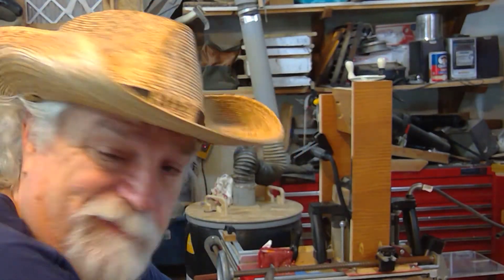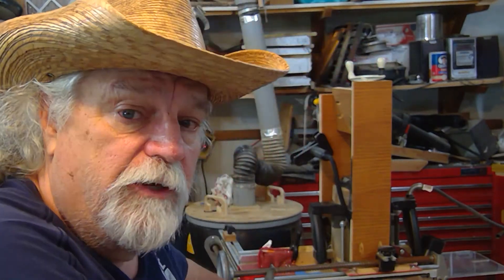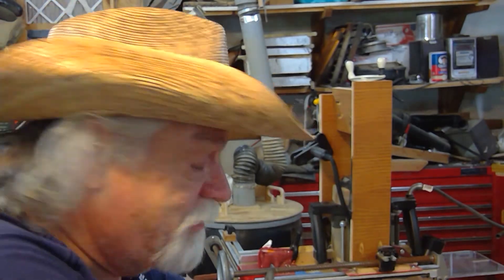If you have a 900 machine you don't have to lock any of them down — you can just lift it up and down, leave them loose. Gravity will hold it in place since all your pressure is down on your work so it's not going to lift up. You're good to go without ever having to tighten it down. Before, you had to tighten it side to side because of the way the system worked — it would always kind of tilt on you because of that single screw in the middle. But now with the full flat spacer it's naturally going to be flat across there, so you don't have to tighten them down for any reason. Give it a try — it works.